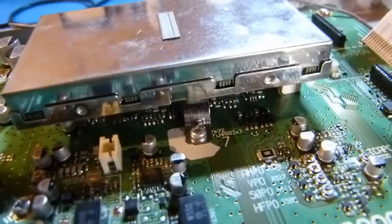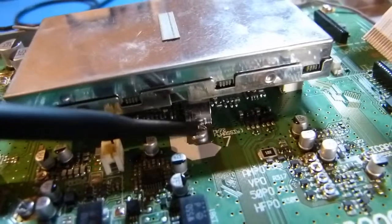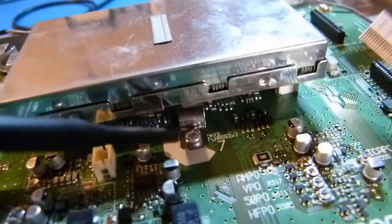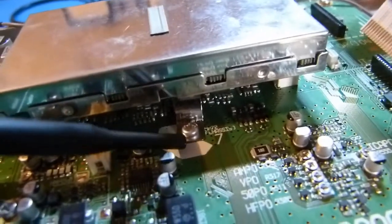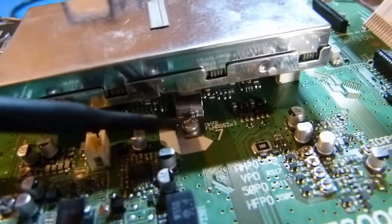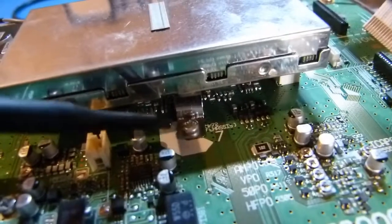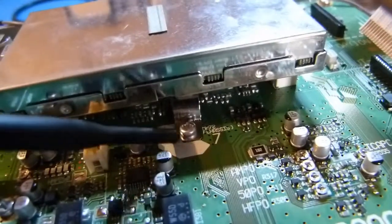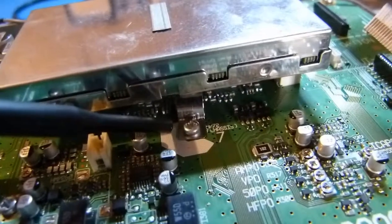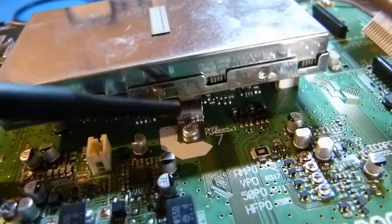Here's a look at this from the side. Here's the can, and the spring clip is screwed down and up under here making good contact with the can. Part of it comes over the silkscreened area where the traces run underneath, but it should be okay — this is how it was before I took it apart. As long as you don't scratch through this or torque it down too hard, everything will be fine. That's probably why the extra piece of silkscreen exists in the first place.